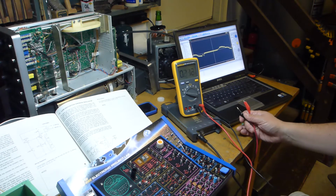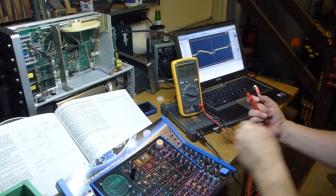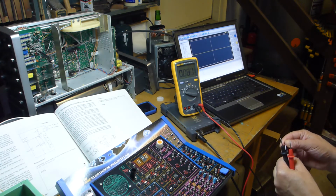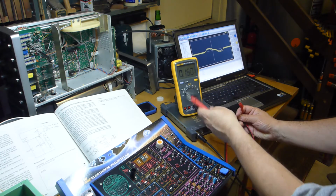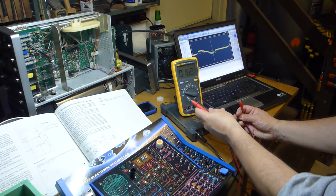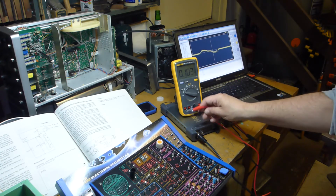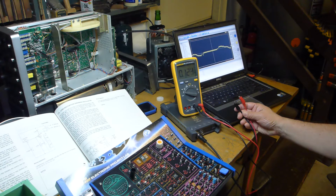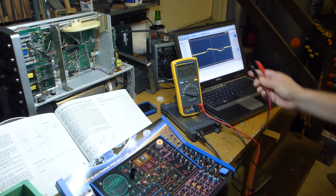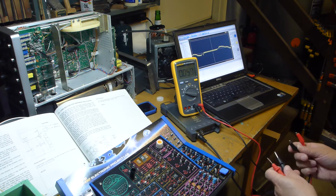All right, another little bit of silliness. I was dismantling things, and I was reminded again that this thing is never sitting exactly still unless you ground out the connectors. There's always this transient stuff going on, and you see the same thing with a regular old digital voltmeter when you've got an AC mode. I believe it's just transient in the air. In the case of this one, since it's tied into the grid through the laptop, there can be noise actually traveling through the system that it's reading. And as a matter of fact, when you look at the frequency, it does want to hover right around 60 hertz. So that's a pretty good indicator.